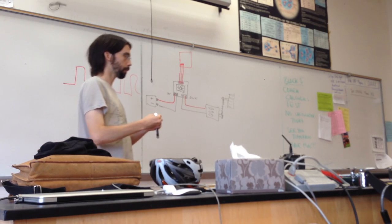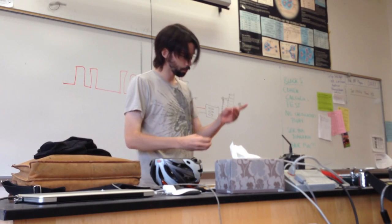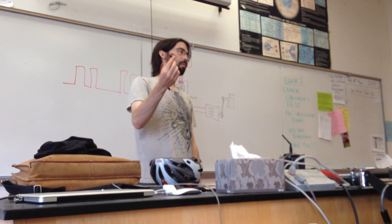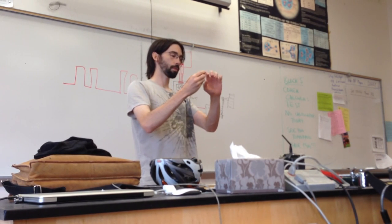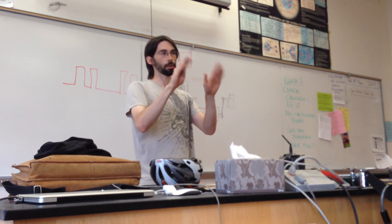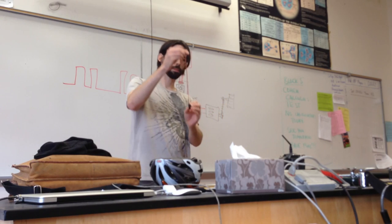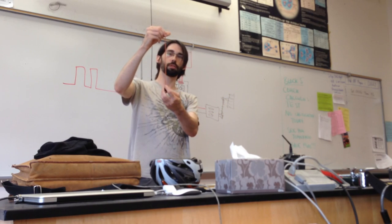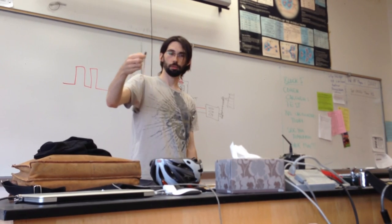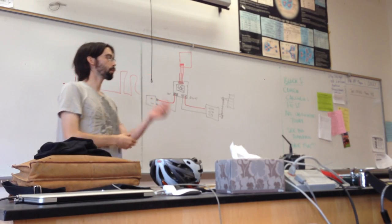Just to be clear, the three wires are often bundled together. Here's a servo motor — this is a very small one, but this is another type of motor you can use on the robot. This one can be told to rotate to a certain angle. So if you had a door that you just wanted to open and close, or a gripper, you can use a servo for that. You can see the three wires have three colors on them, and they have this little plug. You can try it out with the receiver — it plugs nicely into those three little connectors on the end of the receiver.